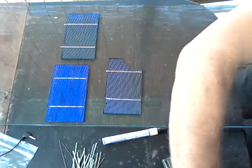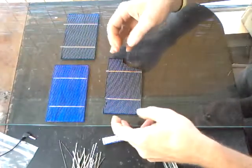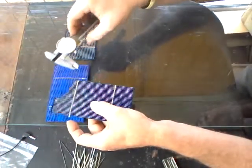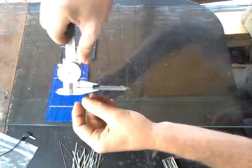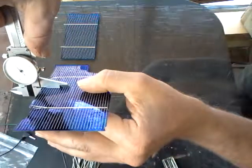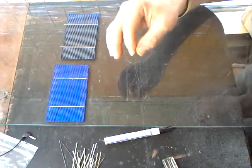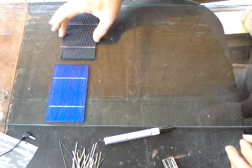Let's go through a little bit of the nomenclature. First, I want to impress on you just how thin a solar panel is. I'm going to use this broken solar cell — it's still functional but not as strong as a full panel. This one measures approximately fifteen thousandths of an inch thick. The average cell is about twelve thousandths of an inch. To put it in perspective, take three sheets of printer paper, stack them on top of each other, and that's how thick these solar cells are. They're very fragile because they are crystalline and they break easily.